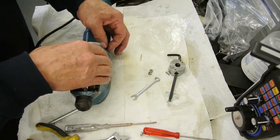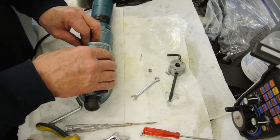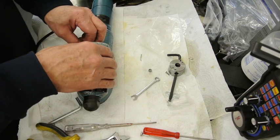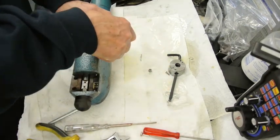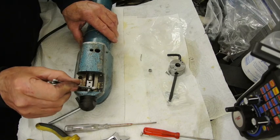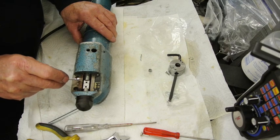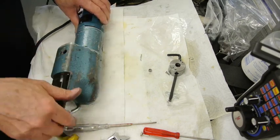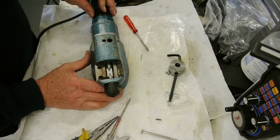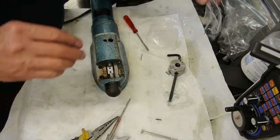It's not a variable stroke machine, but obviously you can set the amount of stroke that it's got, and it should be something that calibrates to where it was originally, and you can tell that by the amount of wear. So that should be fairly easy to determine. And expect it to be running from there. There. That looks pretty close to where it should be.